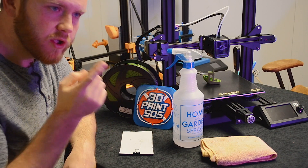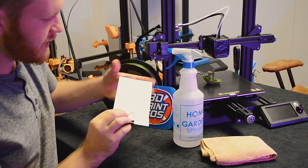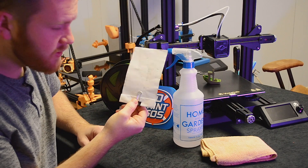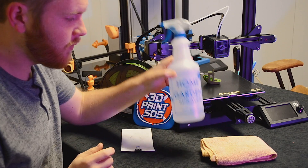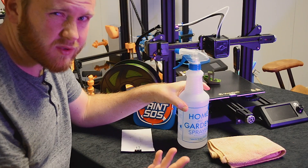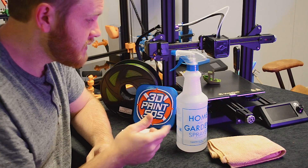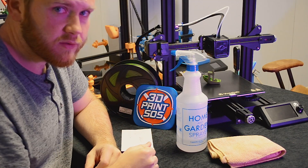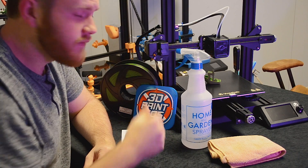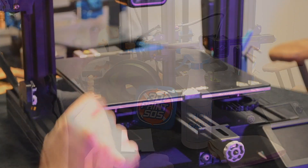So you've got your printer ready to go and your roll of filament. I'm going to make a couple of recommendations. First, we need a piece of paper — I like to make a nice little sliver, roll it up, and put a clip on it so it's easier to handle when the nozzle is dragging between the bed. The other thing you need is some isopropyl alcohol. I like to put it in a small spray bottle and use a microfiber cloth to clean the bed. Isopropyl wipes work too. This gets all the grease and oils off the bed so the filament sticks nice and easy.